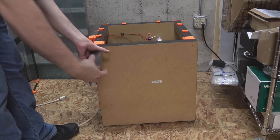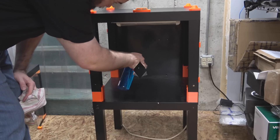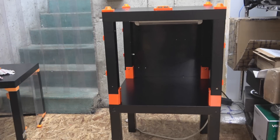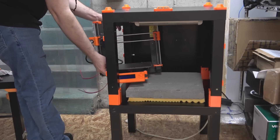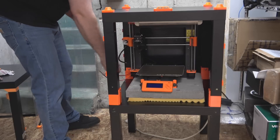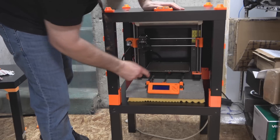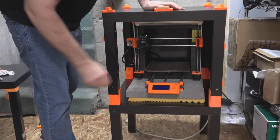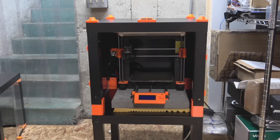Now that we're over here, we'll put our feet back on. We're back in table form and I am going to clean this off — it's very dusty and has all kinds of filament residue on it, so it's due for a wipe down. With that, the bottom printer is ready to go in. We'll go ahead and put in our block — this one will go in from the side. Then we can run our wires out the back and they'll go into those quick connectors. Once it's in and lined up how we want, we're going to make sure that bed doesn't hit the back. We've got a little room, and then we can go ahead and put our other side on. We should be good with the bottom one — almost ready to power up — we do need a front on the enclosure, but we'll talk about that last.